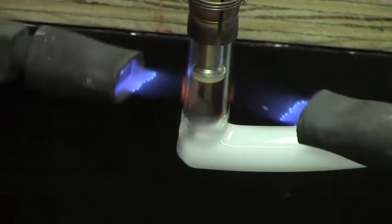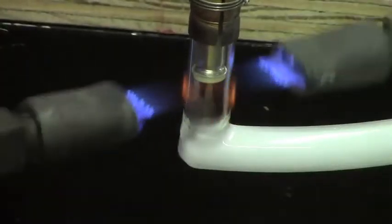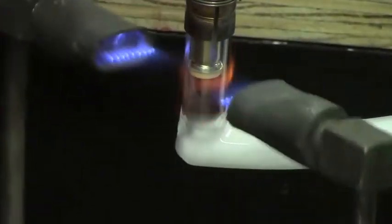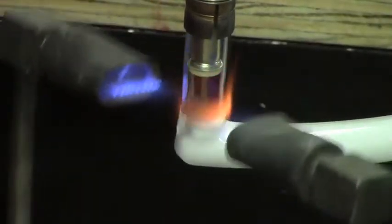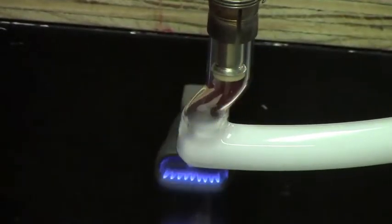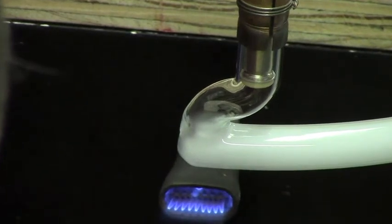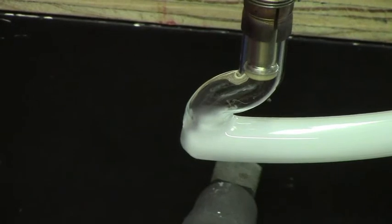To do an offset weld for a typical Lumicron Neon Clock, move the hand torch up and bounce up and down while rotating — that'll heat the next section of glass for an offset. Usually they're offset exactly 12 millimeters, or the width of the electrode. When the glass is nice and liquid, you can simply offset and blow, keeping the heat on at all times right underneath in case you have to make some adjustments.